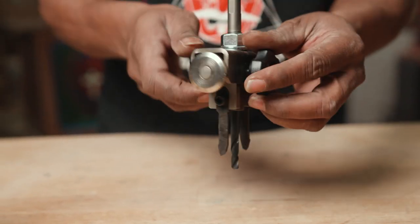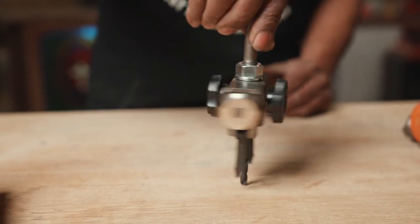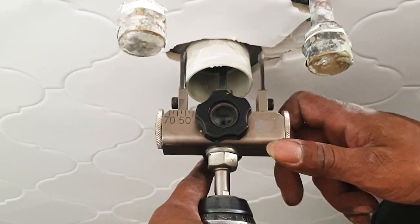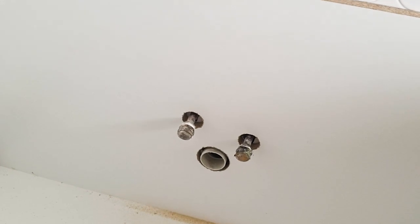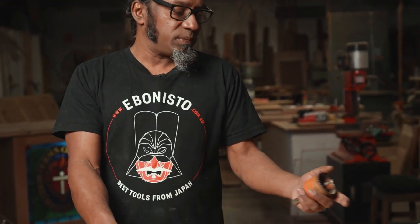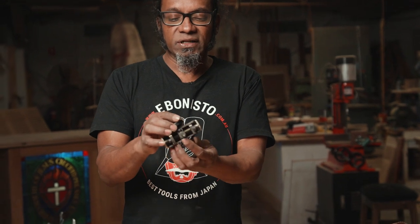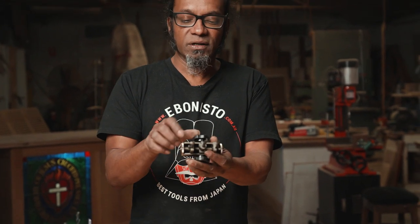Lock both sides and away you go again. All you need to do is adjust the width of the blades and you can get exactly the right hole size. Quite often with the bi-metal hole saws, especially when you're fitting downlights, you'll find they don't match exactly — they're a little bit loose or a little bit tight and you have to rasp away or fill the gap with tape or something like that.